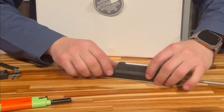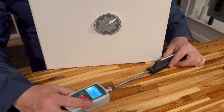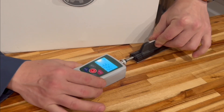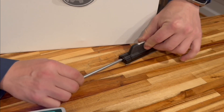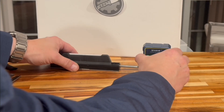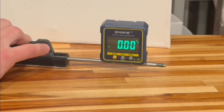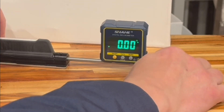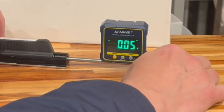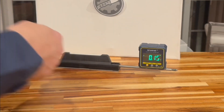Let's check it out. You will notice right away that a little more force is required to move the plate holder on the rod. It went from under one pound to three and a quarter pounds — a 2.29 pound difference — and that's before the bushings were burnished in or even the rod itself. Did we solve the problem? I get nothing — I don't detect any wiggle in the up or down direction, just a little bit of rod deflection. I basically eliminated all the wobble.